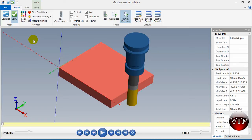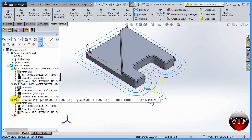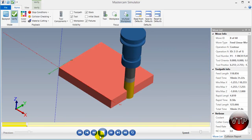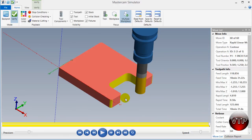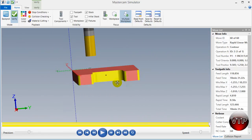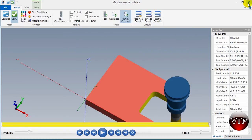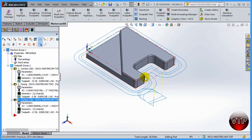Come over here under verify and let's see how that looks. This will only show this operation - I'll close the others. With just this operation selected, click verify and play. The tool comes down, starts at the side, and those two multi-passes were enough - you don't see any material left over. The radii in the corners are being machined correctly. This one corner is not machined because it's a sharp corner in my part, while the rest have radii. This concludes the third operation - the open pocket. In the next session we'll learn how to create the chamfer.